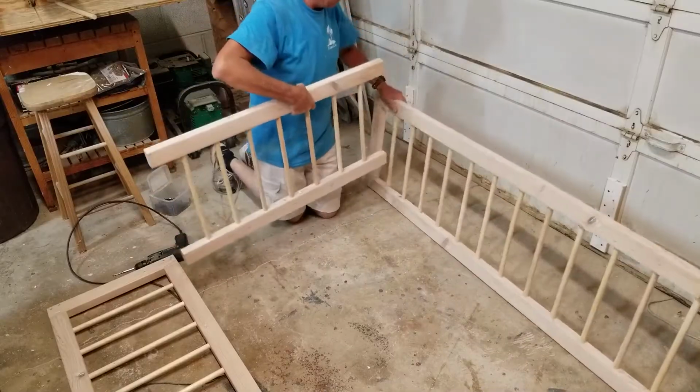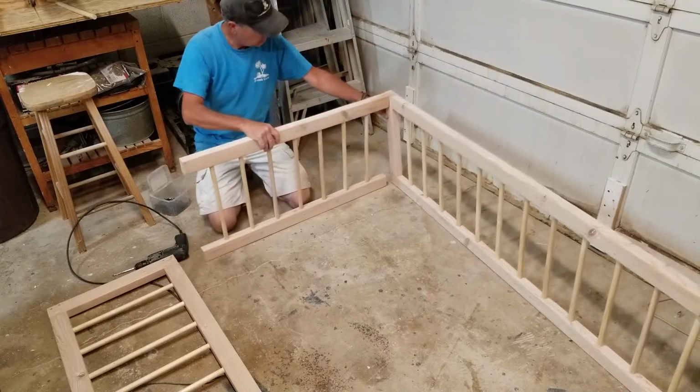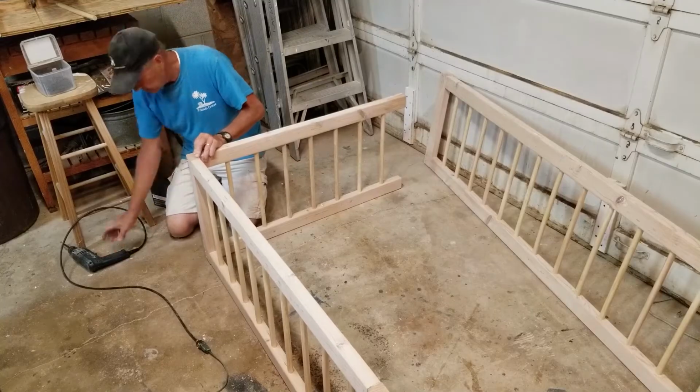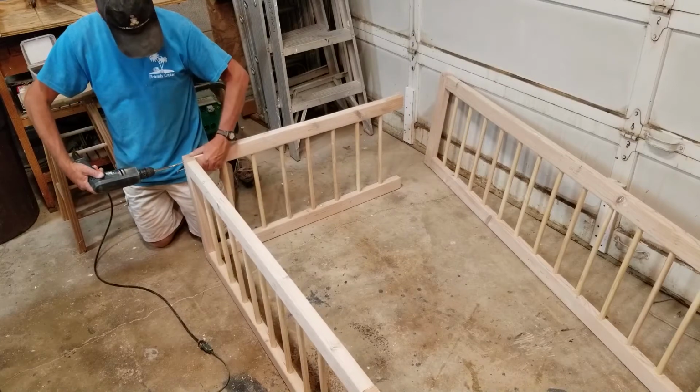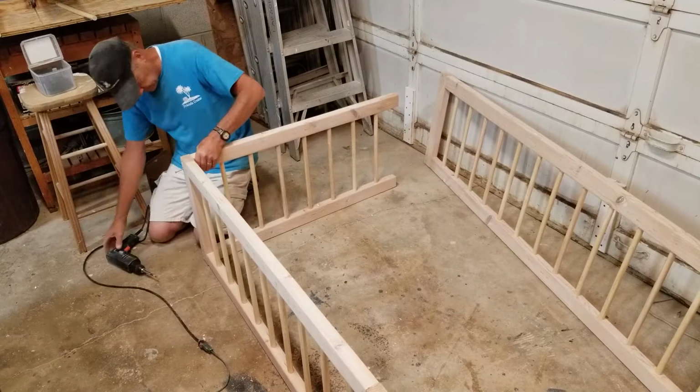Because on the corners there, you've got screws going one way and screws going another way, and you have to try to make them a little bit offset from each other. If they go like that, they'll hit each other if you put one screw in and the other. So on those corners where I'm screwing it in, the holes on one side are slightly off from the holes on the other, so that they miss each other. Makes sense. Yeah. But something I wouldn't think about. Yeah, something you wouldn't think about unless you've made that mistake multiple times like I have when building things.